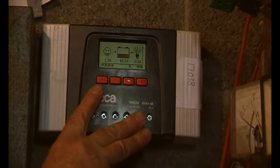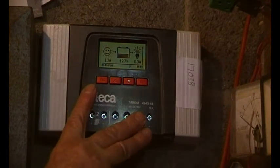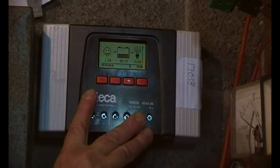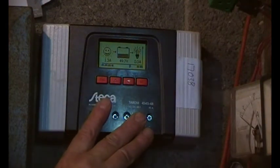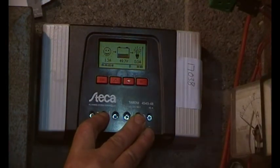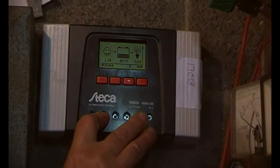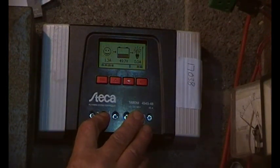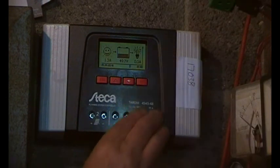This is not the only charge controller I've got. There's another set of charge controllers that are effectively dump load controllers — they go up to a voltage and then switch the solar panels off from the batteries. Because they control a changeover relay, instead of that power being lost it gets diverted to the storage heater in my office, which runs at about 63 volts DC. I've changed the elements in that storage heater so it provides a very useful amount of heat.